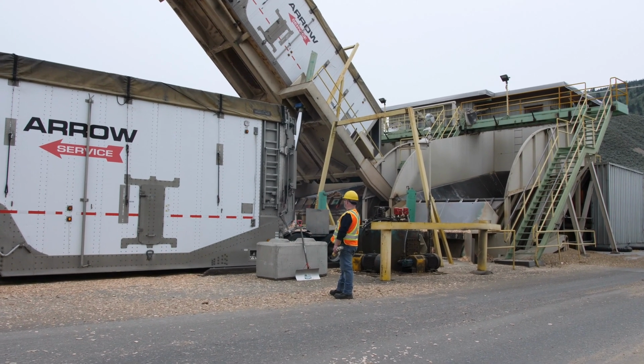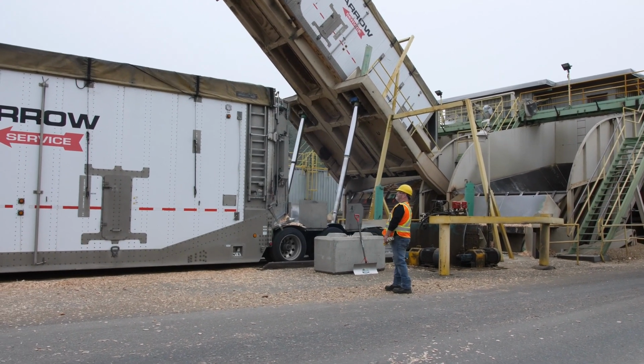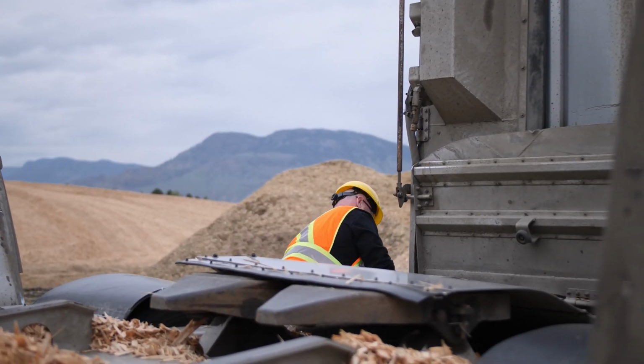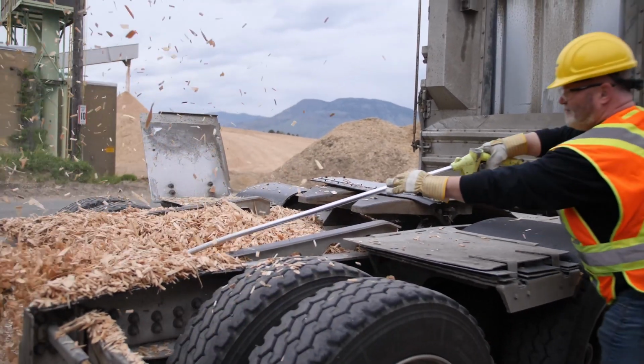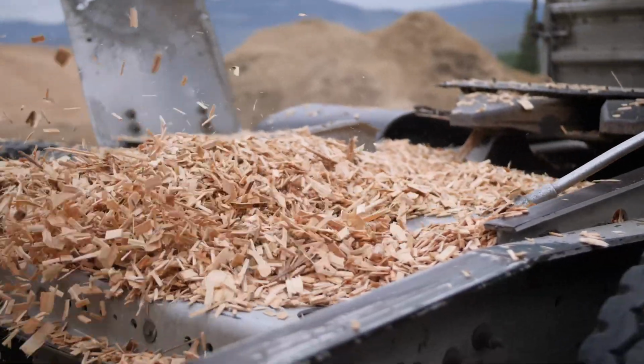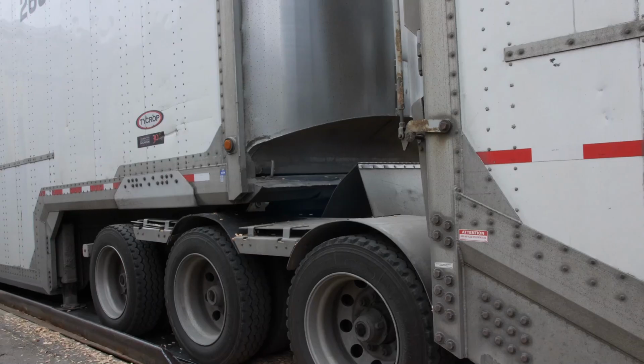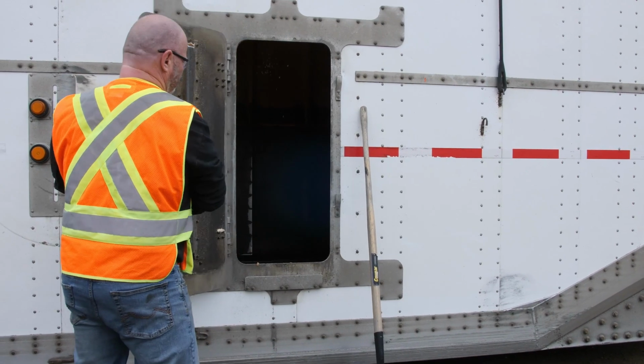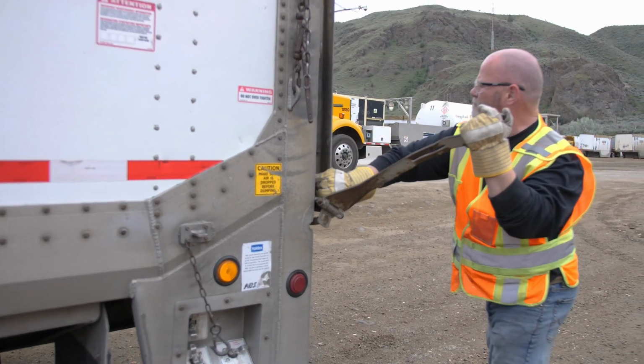Pull in front of your B trailer to disassemble your wings, as this will allow the next driver to start their dumping sequence and reduce weights for everyone. Use the air lance provided behind the booth to blow off loose product. Take down your wings and back up your pup trailer or B box. While preparing your pup trailer, inspect both trailers for any remaining product.